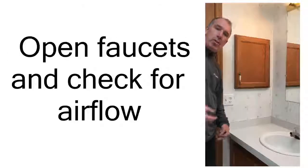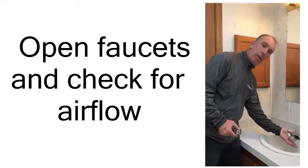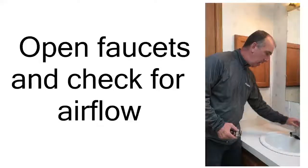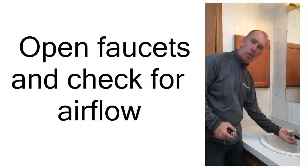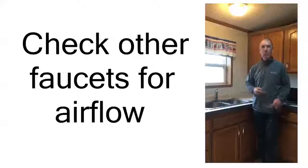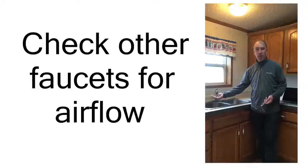The air compressor is running and maybe you can hear it in the background. I've been to one of the bathrooms where I closed the door to keep the noise down a bit, but if you listen carefully you can hear the air blowing out of the faucet here. A lot of air is coming out — the water's already been pushed through the system. I've got both the cold and the hot valves wide open, and it's doing what it's supposed to do: blowing the water out of the water line until you feel nothing but air. You want to feel that air blowing on your hand — that's how you know you've gotten rid of the water. While the air compressor continues to run, I go to every faucet in the home, open them all the way up, and look for a nice blast of air coming through, which indicates all the water is out of that line.